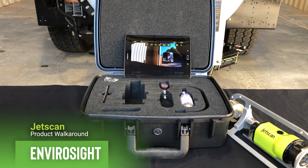This allows you to manage your resources. Now you know, when you leave this position, that the line is clean. You know exactly what step is next — do you need a construction crew, do you need a detailed inspection via your mainline camera system, or perhaps it meets all your criteria and you don't need to do anything? You're not burning more fuel, you're not wasting more water, you're not sending your jetter pumping water down a clean pipe, and you're not sending your camera crews trying to inspect a pipe they can't access because it's obstructed or dirty.